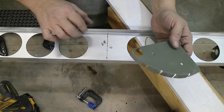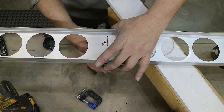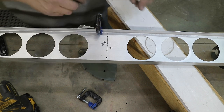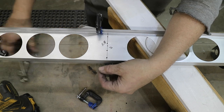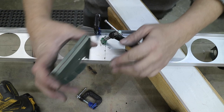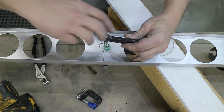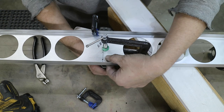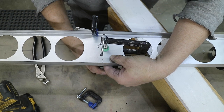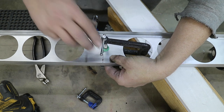I'm going to attach the nose rib. This is the bottom, this is the top, that's the tip. The flange is generally going towards the tip. The first thing I'm going to do is put a piece of heavy sheet metal on here as a guide, and I'm going to bring this rib back. I've taken and drawn a mark down the center of the rib - bring it in place until I can see that mark, fiddle with it for a while, and then clamp it down.